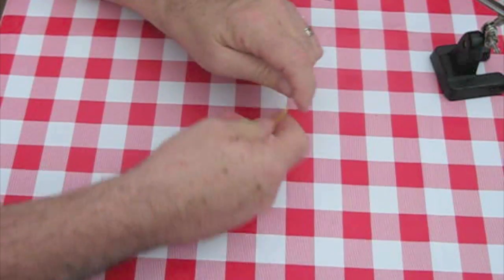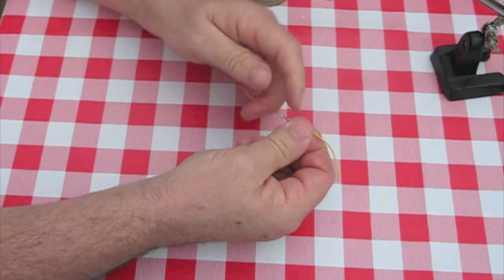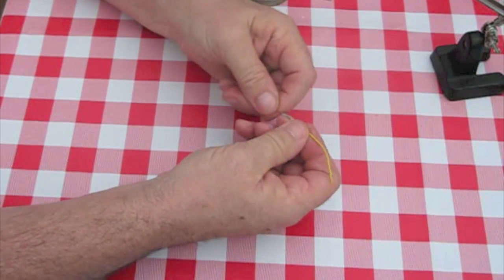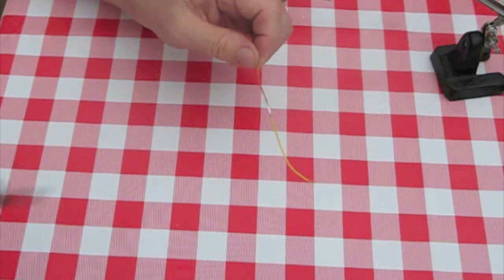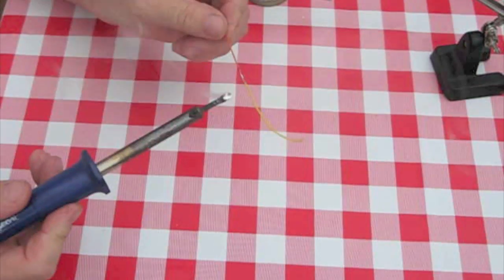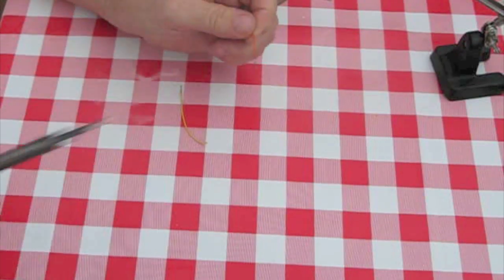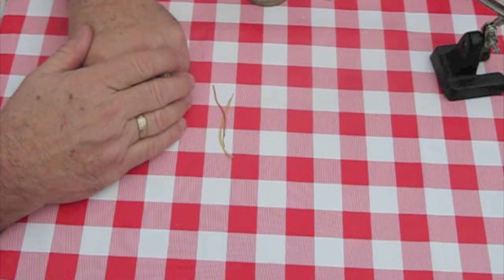Get a little knife or something, shave off the insulation, and just go through the soldering which I showed you earlier. And there it is — that's a really good solid joint, probably stronger than the actual wire itself. If you ever want to disconnect a wire, clean your soldering iron, add a bit of flux, and as you can see as it melts, it just falls apart. It's that simple, and that's how you do it. Thanks for watching.